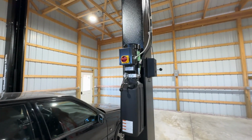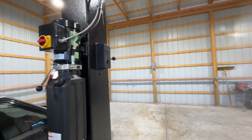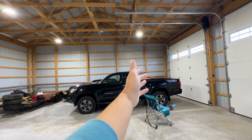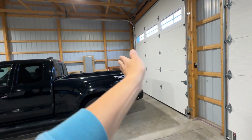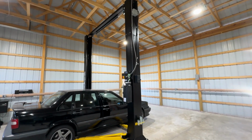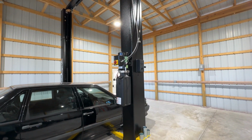So that if this switch ever gets stuck, you can quickly run over there, cut the power to the thing, instead of having to weave your way over there to the panel, because the panel's 30, 40 foot away. And God knows what's gonna be over here. So you'd have to be running through all this stuff, trying to cut that breaker off if that ever gets stuck or if something bad ever happens electrical wise.